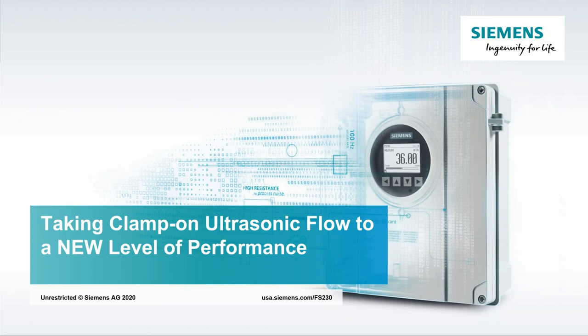About three years back was our first launch of the FS230, our general industries meter. In the latter few months, we've been releasing the hydrocarbon and clamp-on natural gas versions as well. One of the biggest things that sets it apart now is what we call the one platform or digital platform, where all our flow technologies — Coriolis, magnetic, and clamp-on ultrasonic flow — all sit on one platform with the same hardware, software, programming menus, and feature sets. Anything new or updated for any flow technology, they all get it. That's a huge advantage going forward.